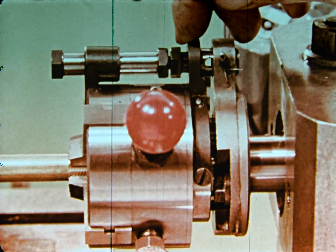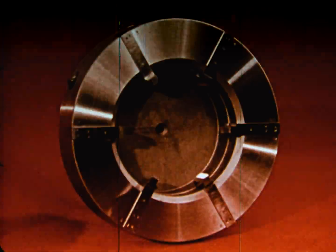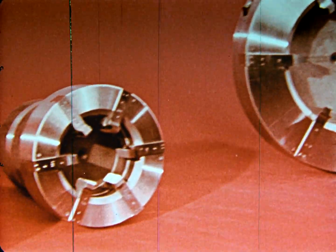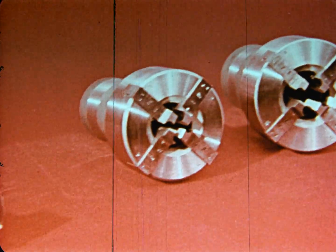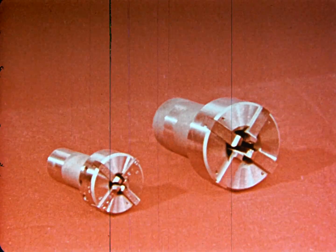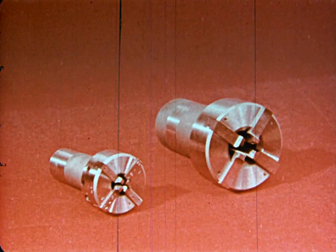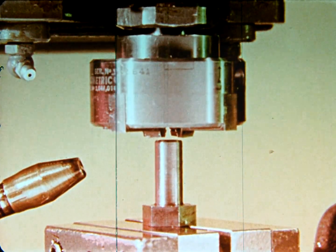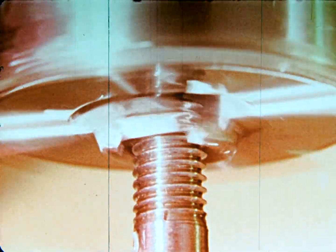The tools demonstrated so far have been of the self-opening variety. The solid adjustable die head is another type and may be used advantageously for certain jobs. For example, solid adjustable die heads are made in a wide range of sizes, from large tools capable of cutting threads 6 or more inches in diameter to this very small model. Outstanding features of this fine tool are compact design, simple operation, positive chaser adjustment, close to shoulder cutting, and important too, low initial cost.